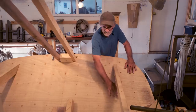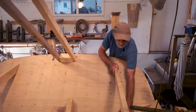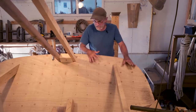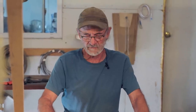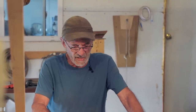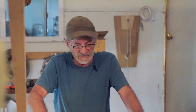It does have a framework put into it — nice white oak, quarter sawn. This transom has got a hell of a rake on it. It's really raked out there, so every angle on this transom and every piece has got angles more than 45 degrees. That makes the pieces very tricky to cut no matter what you've got — a ship saw, a bandsaw, whatever. It's not causing us any trouble, but we've had to think about it quite a bit, and I guess we've got it figured out.